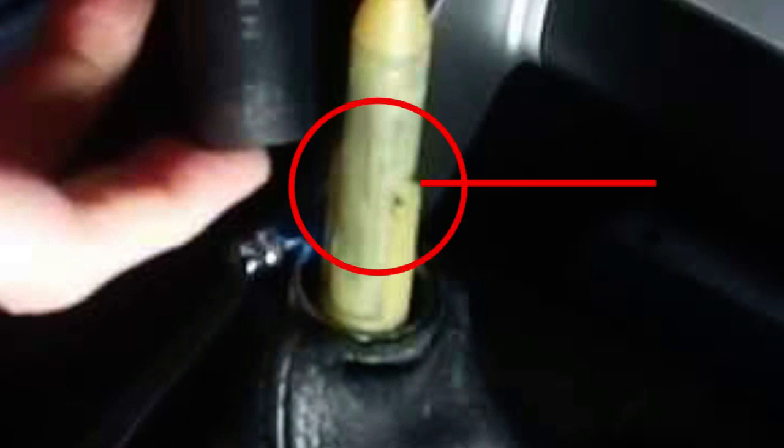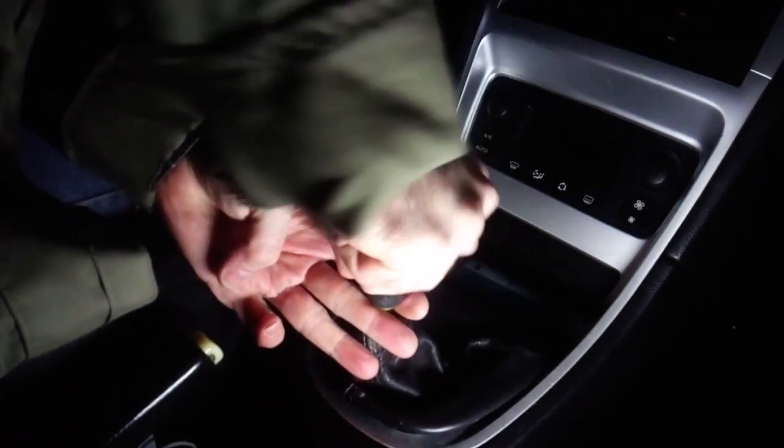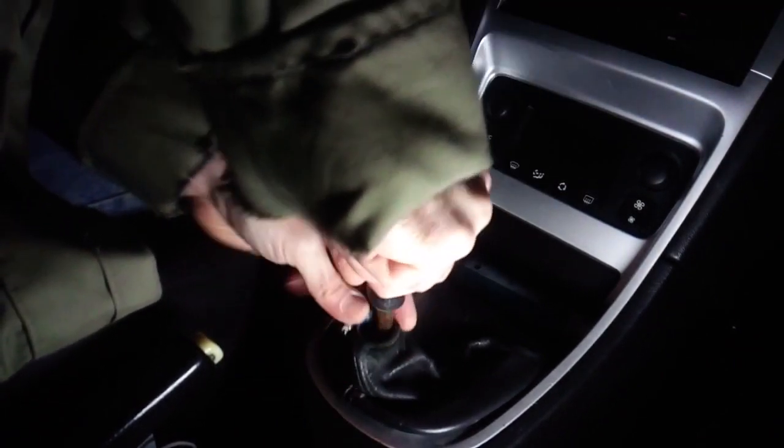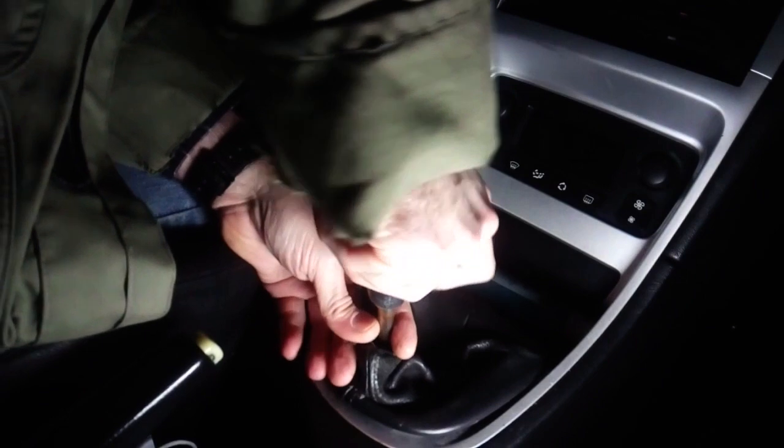So here's why I chose such a small length of copper pipe. See, this plastic sleeve has these two protrusions to the sides which don't allow the copper pipe to go any lower. But the rubber hose is flexible enough to hug them and go all the way down. This rubber hose is actually short. I could have used a little longer one so that it covers all of the plastic sleeve all the way down, but this setup is also effective, so no worries.